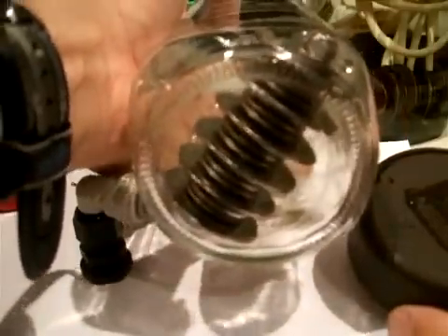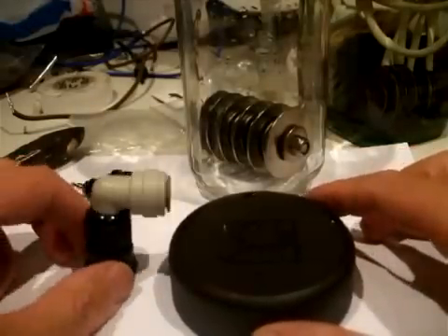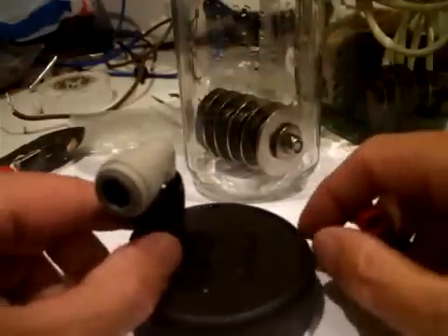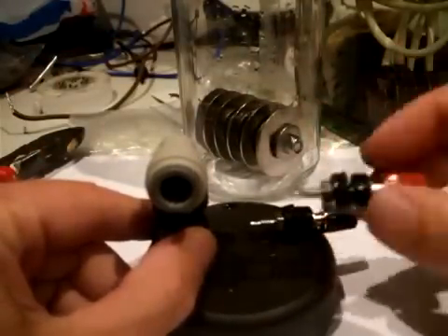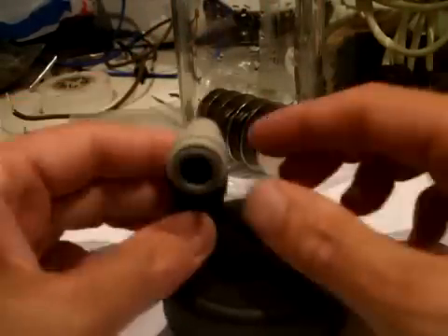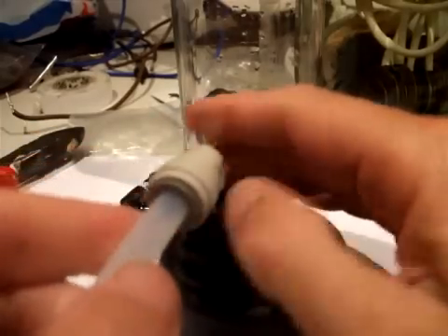This is just showing the cell sitting at the bottom of the jar and rough placement of the exit pipe and power terminals on the lid. I picked up the power terminals from Maplins, and Radio Shack should stock something similar. The pipe fittings came from a bar installation company, although a plumber's merchant should be able to supply something to fit — this one has a surface-mount screw fitting. In the future I plan to have the anti-flashback material mesh or wire housed within this elbow, and also a moisture-catching filter fitted to the inside of the lid on the exit pipe so as to prevent any moisture reaching the air intake manifold when the vessel warms up.